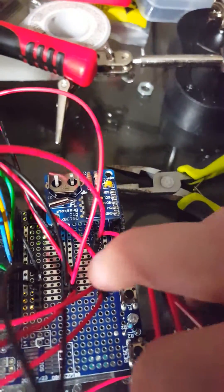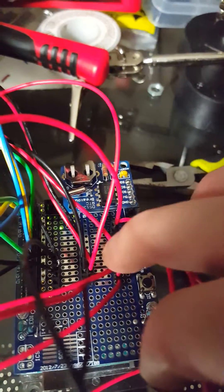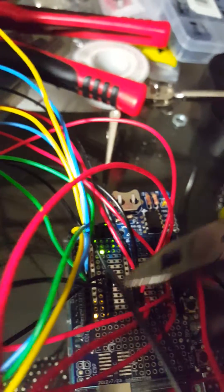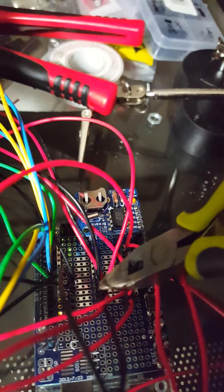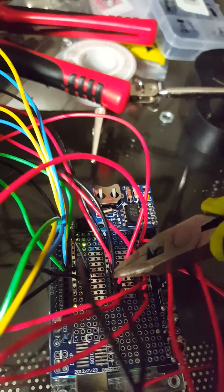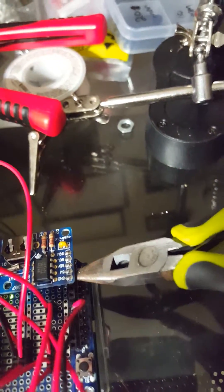On the right-hand side I've got all my 175-volt high-voltage stuff, and on this side over here I've got all of my ground. In the middle I've got my 5-volt and ground logic for all the shift registers. I've got my DS1307 back here running with the battery — well, this one doesn't have a battery, but yours is going to have one. I'll put one in mine as well.